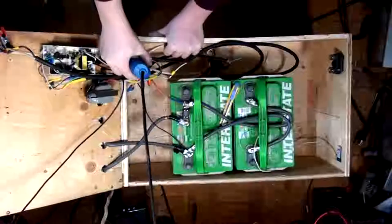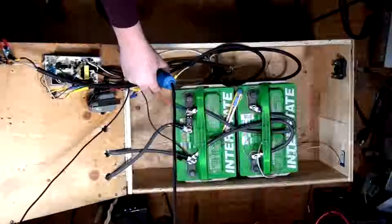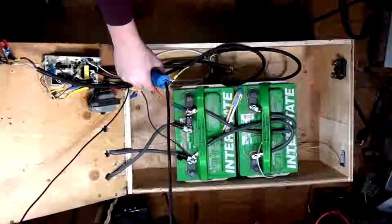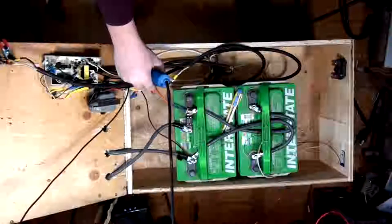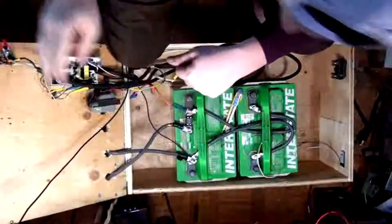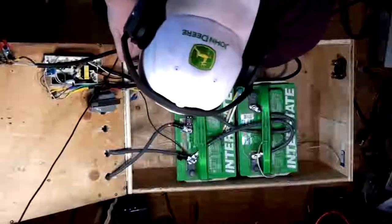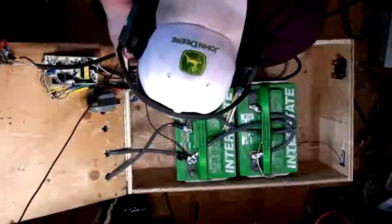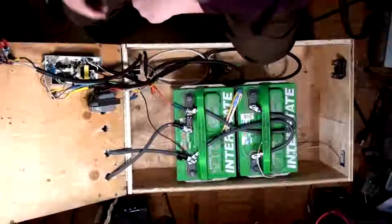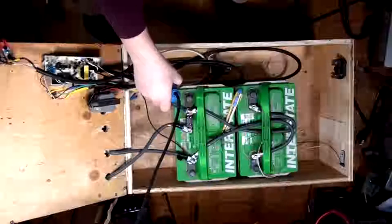Almost forgot. Gotta get down here and get this one. Here we go. Making sure all the 120 volt stuff is properly insulated. There we go. It's that connector. I think I've got enough left of these cutoffs that I've got to do the last one, which is the neutral. The ground I'm going to leave exposed, which is perfectly fine. Here we go. So I intend to actually stick the ground on there, and the ground should be exposed anyway, because if anything shorts, it should be hitting the ground. So, whatever.